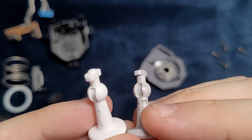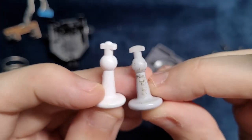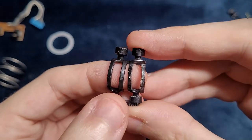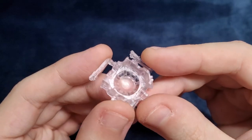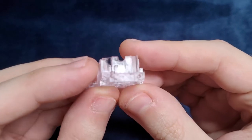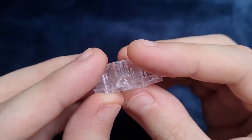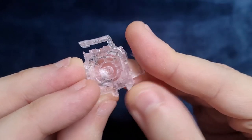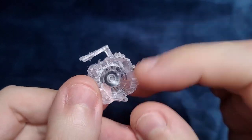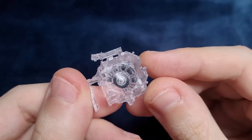And the stick was fine, except for the base. The part that touches the bowl has been completely grinded too. Same goes for the gears. Here's the resin casted piece. The slots for the gears are alright, but the hole that holds the encoding wheels is a little bit too tight. There are also some bumps in the edges too. But the most important part, the center of the bowl, is very smooth, and I think we can work with it.